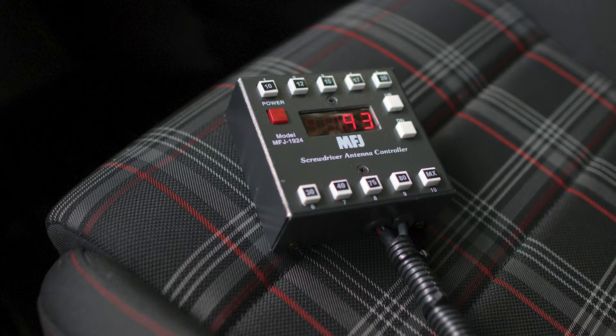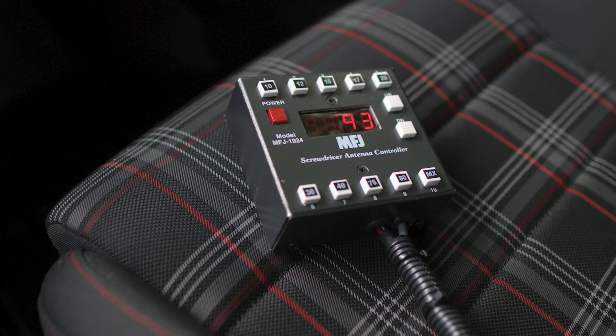I went a step further. I used for about 18 months an MFJ-1924, which I'll call semi-manual. The antenna has a reed switch in it that allows the controller to count how many turns the antenna has moved. So, for example, with the capacitance hat on the antenna, 17 meters is at zero turns, 20 meters might be at 31 turns, 40 meters is at 96 turns, and 80 meters might be around 156 or so.